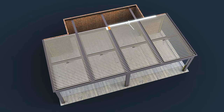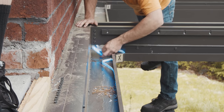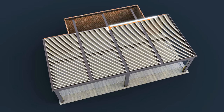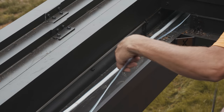After you've located your first power supply and controller, it's time to lay your first strip out in the gutter. We're going to run it directly out of the controller and un-reel the full reel, which is 16.4 feet. As you can see here, the reel doesn't go all the way around. Because these reels have a maximum length of 16.4 feet, when we want to add a second reel, we need to add lead wires. These lead wires need to be rated for something with the load, such as this strip light.